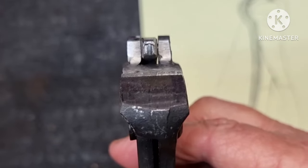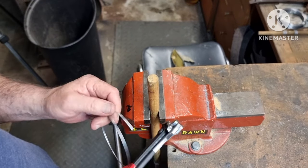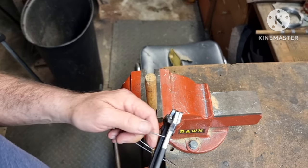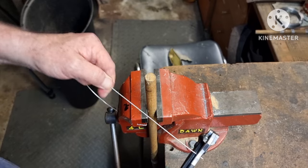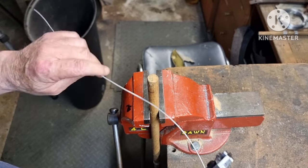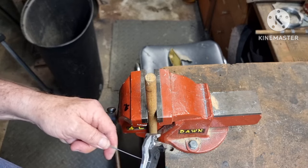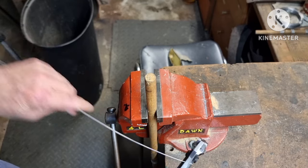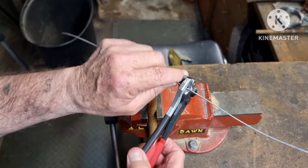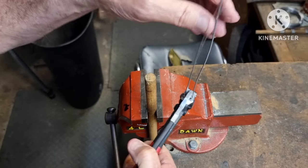So this is my recommended method of operation: pinch the wire, pull it back and straighten it out. A little bit of fussing around here but get the wire as straight as you can. Now place the wire in the middle of the lever, hold it tight, bend it up — and this gives you a nice little square end which helps with assembly.